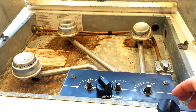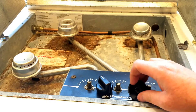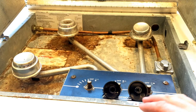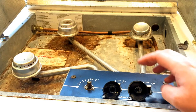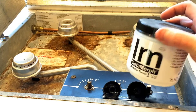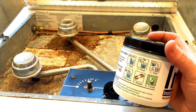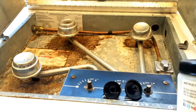I've been trying to find an equivalent knob. I found this one is a similar size, but it's not an exact match because the center section is smaller, so it doesn't fit. What I'm going to do today in this video is demonstrate how I'm going to make an adapter — lob off this center section and make a little interface piece out of moldable plastic called Instamorph. Instamorph is like a pellet. You put it in some hot water and it starts to melt and becomes soft so you can mold it into shape — mold it so that it fits our knob here.